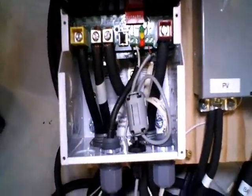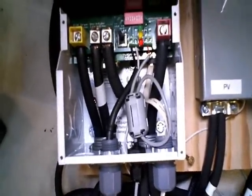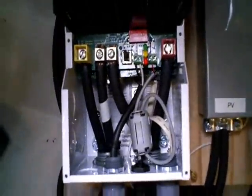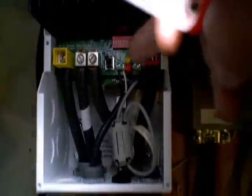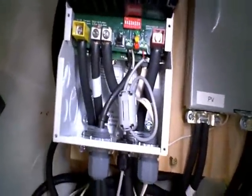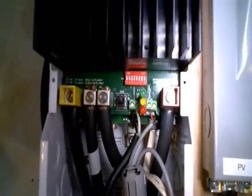It came with a little attenuator to clip on the sensor wires. The other two little terminals alongside the LEDs are for the battery voltage sensor, positive from the PV panel, negatives both to the battery and to the PV panel. There's a ground lug in the center — the housing should be grounded. It's got a little set of DIP switches to set it up as far as whether you want it to automatically equalize or if you want that to be started manually.